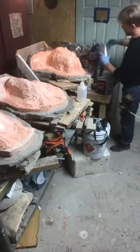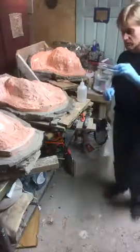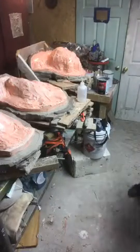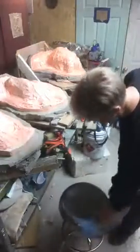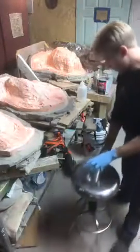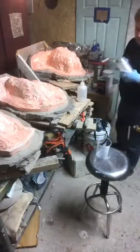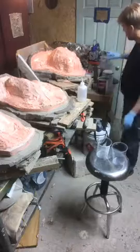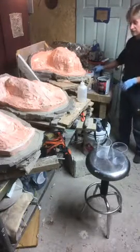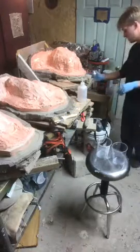Now what we do for doing this, we use these 32-ounce cups. Let me find another chair. There's a stool. Give me the stool. I'm going to do this right in front of you. We use the 32-ounce cup so that I know how much Bondo I'm going to do. And then I'll just mix a couple at a time, and then I can kick them, stir them, do them right out of the cup, and then toss the cup away when I'm done, because all the brushes, all the cups, all the things you use for this are trash. They're no good when you're done.